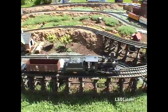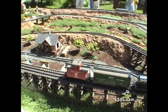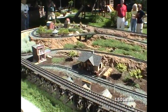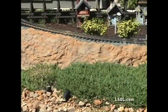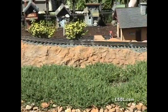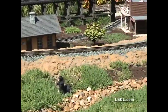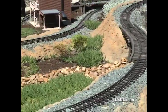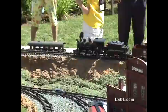So how did you make the mountains? We started with bags of concrete that we poked holes in and split open. In some cases, we poured the concrete into smaller bags at the lower ends of the hills and watered all that down to solidify it. And after that hardened, we used a landscaping mesh. It's a plastic mesh with half-inch square holes in it, and we shaped the sides of the hills with that, tacked it in place, and on top of that, we spread the mortar.